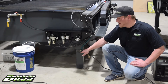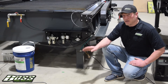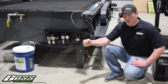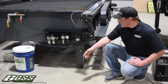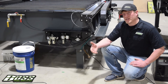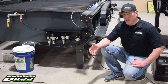We're going to go from here to the power unit, to the casework of the power unit, and from here to a ground rod. We want to see a very low resistance path to the ground rod. It is better to drive ground rods on top of each other with a ground rod coupler than to physically start laying ground rods in a grid. We like to typically get it under one or two ohms, because the lower the resistance to ground, the better drain we have for noise, essentially protecting your equipment — and it will actually cut much better.